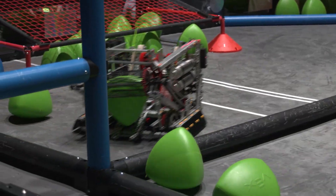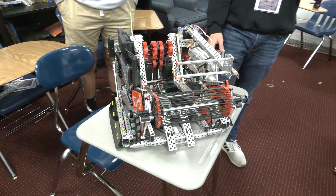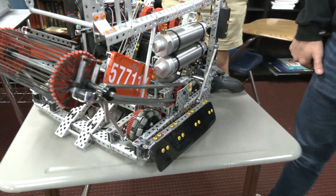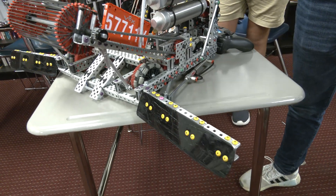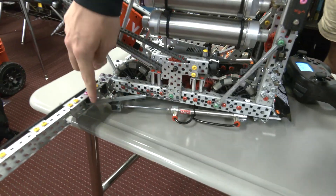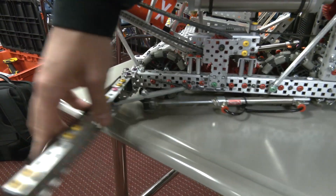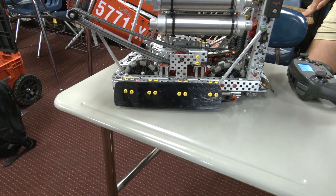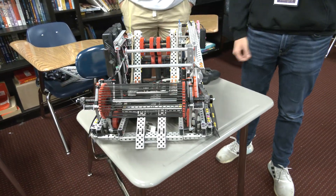Talking about the wings on your robot — when did those get added, and how have they been working out at the event? So after Mall of America, we decided to do a basic wing design — just a C-channel — but you can see we added polycarb after that tournament. We also decided to do locking wings. When I expand these, you can see they're pretty long and can cover quite a bit of surface area. They're locking wings — when we expand them out, you can't push them back because they're stopped by a shaft. When we pull it back with the piston, the piston pulls the shaft away so it retracts. So no tri-ball in the robot can move them, which is very helpful when pushing tri-balls into goals.